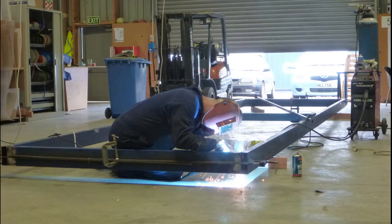We used an anti-splatter product that you spray around the areas you're welding to reduce splatter sticking to your metal. It did a very good job, but we realized the anti-splatter product is not great when you want to hot-dip galvanize your trailer — the zinc tends not to stick where you've sprayed it. I would not recommend using this product if you're going to galvanize. I ended up using an abrasive pad to rub off the anti-splatter.